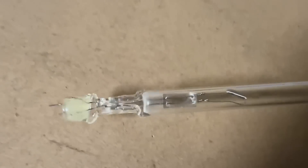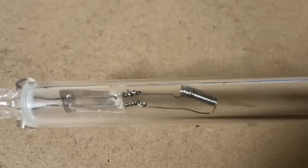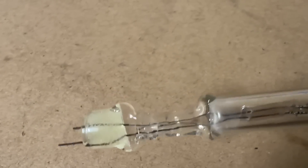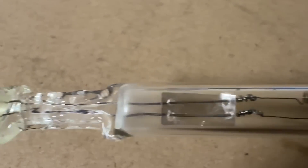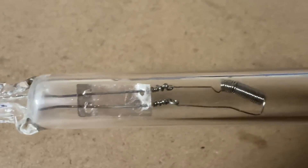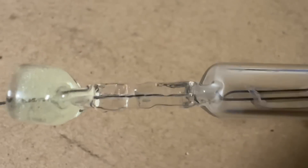What I have here is one of several attempts at making a cold cathode x-ray tube. There is a coil consisting of titanium wire that's been wound up, and the wires that go through the glass — which I had to melt into the glass to get the glass to wet the metal — consist of molybdenum. I've got a tiny piece of mica to keep the leads from shorting out, the titanium wire is wrapped around the ends of the molybdenum and pinched off for an electrical connection, and I added two-component epoxy for further sealing, to hopefully get a gas-tight seal.